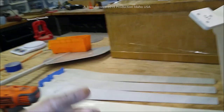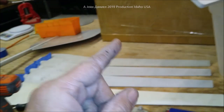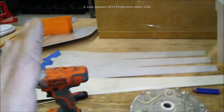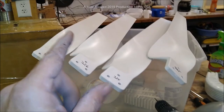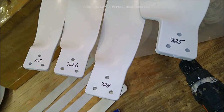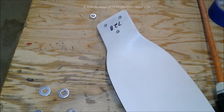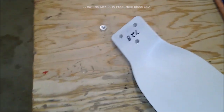Sitting on a pole in my backyard is a 2011 model — it's still running today with its original blades. I want you to look at these blades and see these numbers carefully. That's grams. This is the heaviest one, being basically about three to four grams out of whack of the lightest one.